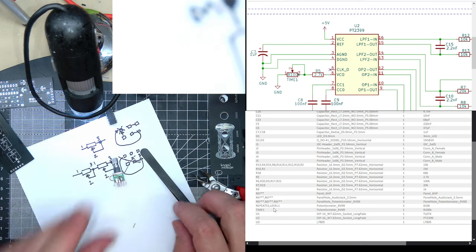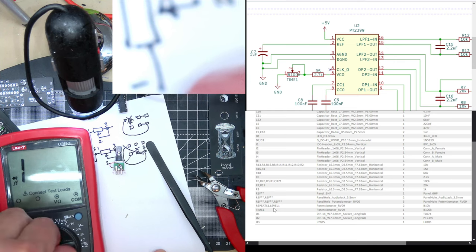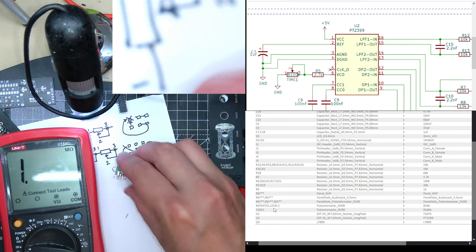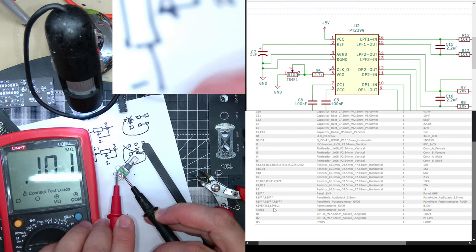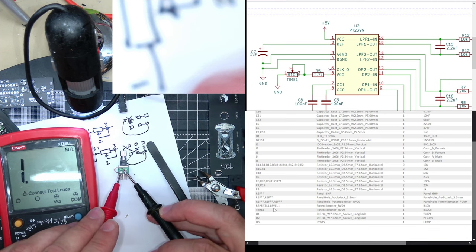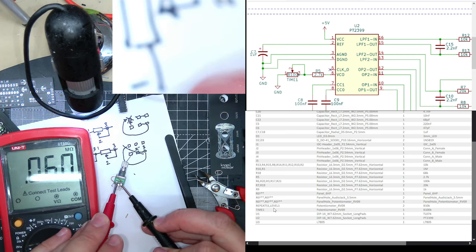What I might do now is just test that it works like I'm imagining. So if you see that multimeter, do ohms. If I turn it all the way clockwise, I should see between here and here roughly 100k. Yeah, because that's in megaohms. There you go, that's 100k. That should just be 50k. So if I did it roughly halfway, I should get what? 60k.